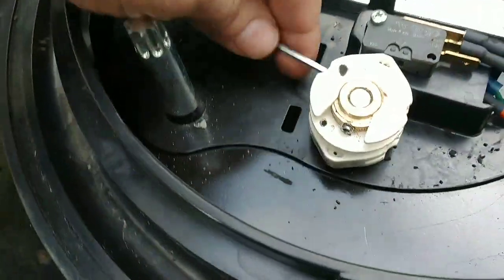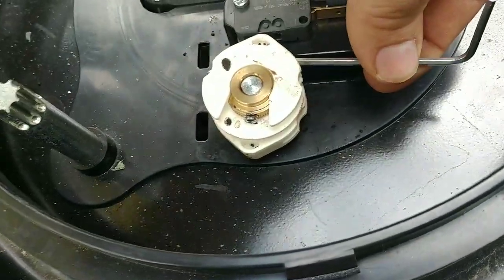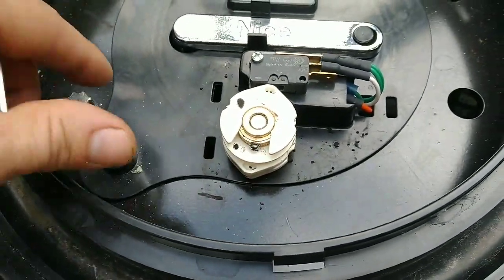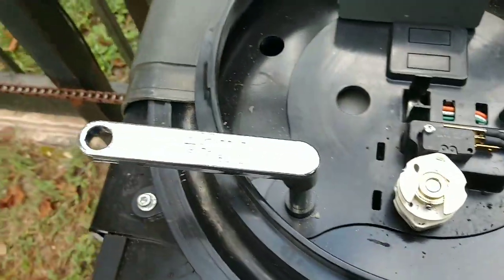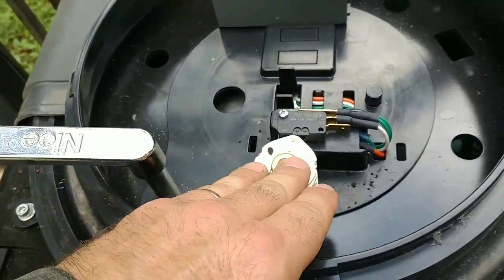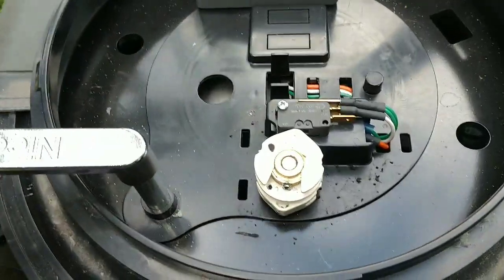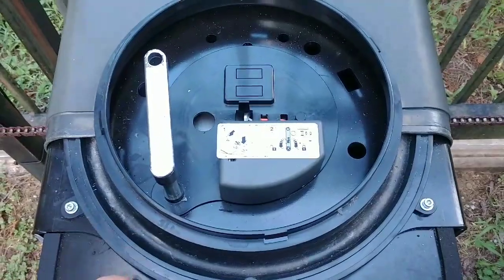You can get to your slots from either side of the cam, but they're not always in a position where you can use the fine-tune adjustment. You can use the emergency release and physically move the gate by hand to get the cam in a better position if needed. But typically, if you're already in that open or closed position you're adjusting, it's usually right where you need it to be.